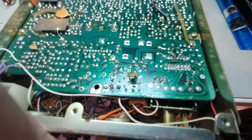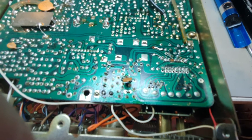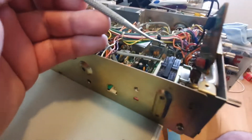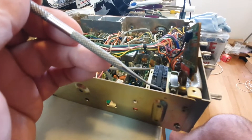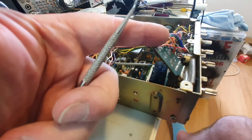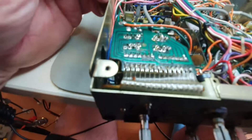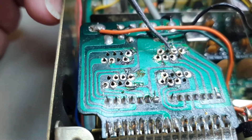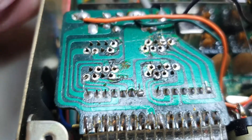I've got the board as clean as possible — a real improvement on what it looked like when I started. Remember, cleanliness is the best way for future work; take pride in your work. We flip it over and install the top side of the board. Because we've got two rows of pins, you want to make sure all those pins line up — no bent ones, no residual solder — then slowly mount the board down and check all pins have come through before soldering. I bend one pin at each end to hold it in place and then start re-soldering.